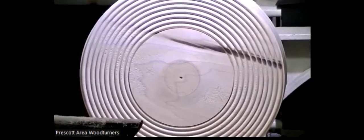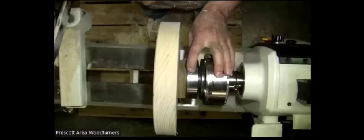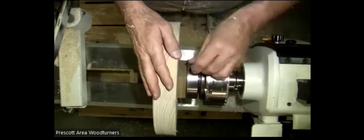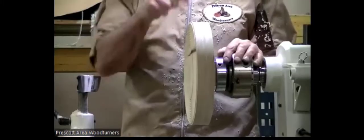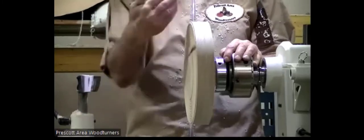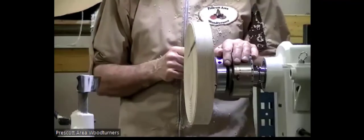The main thing here is the off-center. The beauty of this chuck: there's an Allen screw, and there's an area that shows the amount in millimeters. You loosen the Allen screw and rotate it — there's four millimeters, eight, twelve, sixteen. I'm going to set it to twelve millimeters, then retighten the Allen screw. I can go back to zero just by taking it back to zero, and it's perfectly aligned dead center. I can go back to twelve and back to zero — you don't have to worry about marking something to try to get back to the original position. That's the advantage of this chuck.